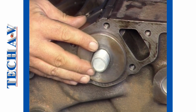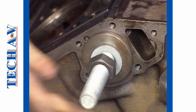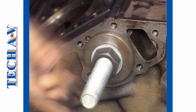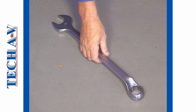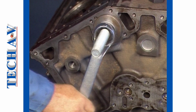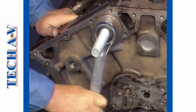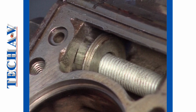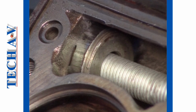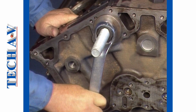The threaded rod is pushed through both dollies, and the nuts, with plain washers, are hand-tightened. A suitable spanner is selected. The forcing nut is tightened on the support dolly, and the bush is forced out of its housing. The operation is simple and requires easily constructed tools.